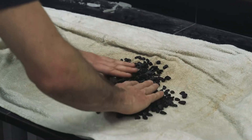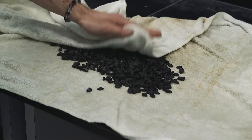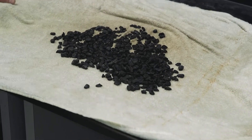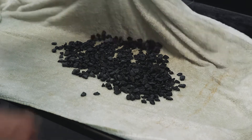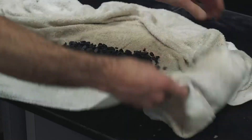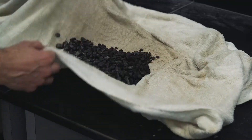We're quite close to SSD. We can see most of the sheen has been removed from this portion, though some remains. In Colorado's very dry climate, if we just sit and watch, the aggregate begins to over-dry — you can see the corners and edges beginning to turn gray, which indicates overdrying. Once we reach the SSD state, we have to move very quickly to avoid evaporation and get a weight recorded. If you overdry it, you have to soak it for another 30 minutes and begin the process again to get an accurate SSD.